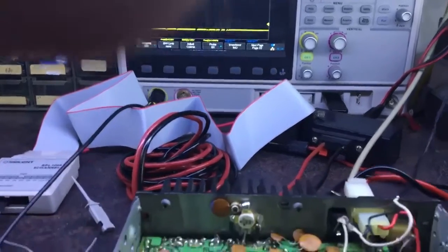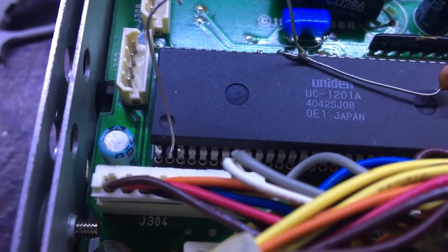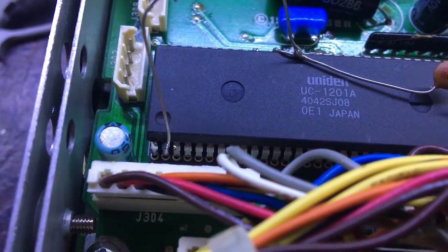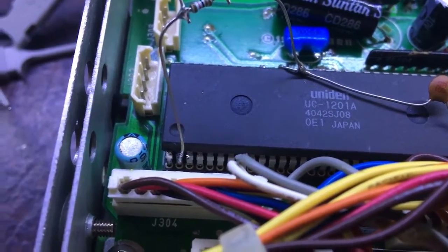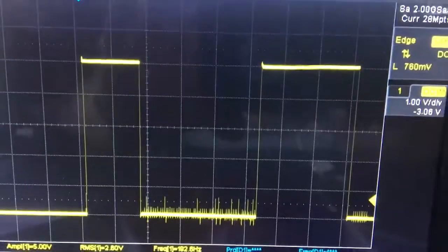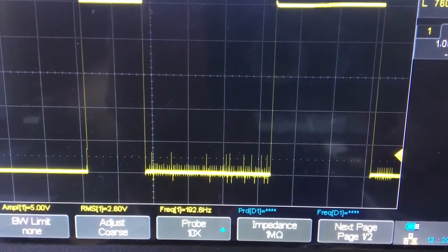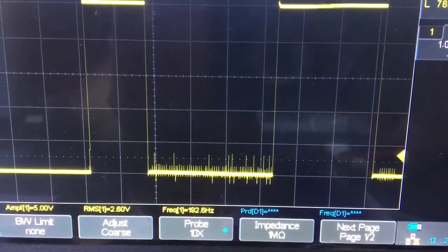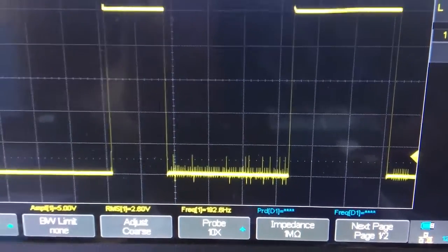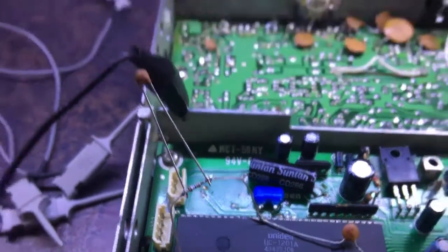That's what I'm suspecting it is — the ringing on the digital lines. There's another digital line right next to it which I need to look at as well, which is possibly affecting it, because I've seen there's a ring on that one too. I've just done a quick probe on the chip select pin, which is the next pin — pin 3 — and you can see there is about 0.7 of a volt ringing on it at worst. And that is with the filter currently hooked up to the second pin, so I'll try it again in a second.